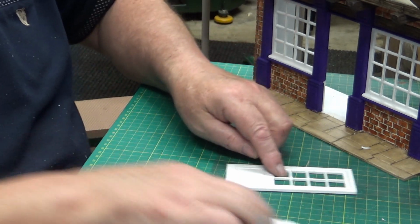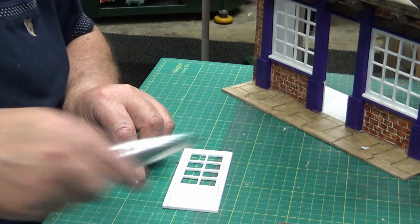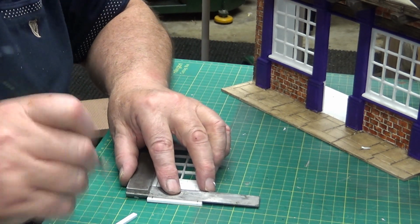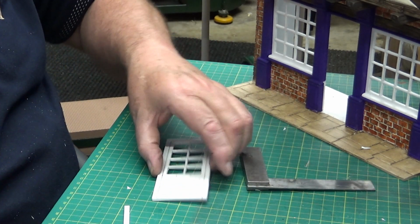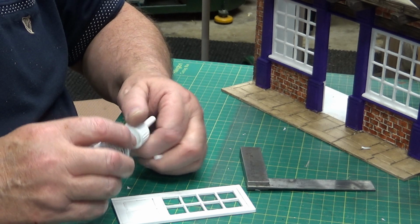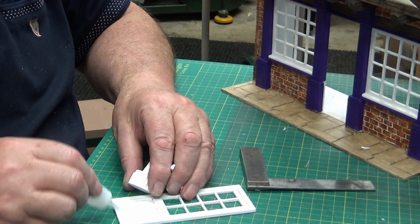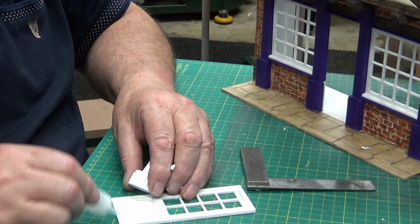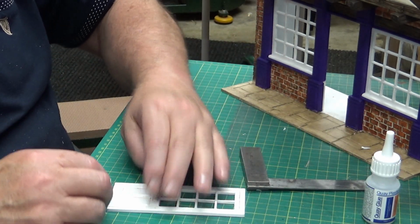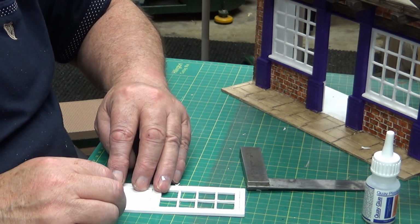And then what we do then is, because this is a door, what you don't do is put it right to the very bottom. So you can actually draw yourself a line, if you feel more confident with a line. Something like a 1/16 off the bottom. Little bit of glue along it. Not too much. Right way up. And then just drop it on in between. Like so,